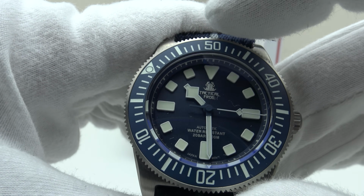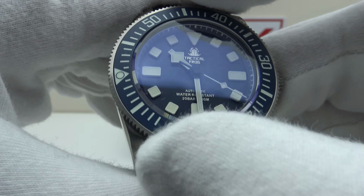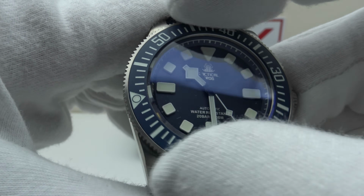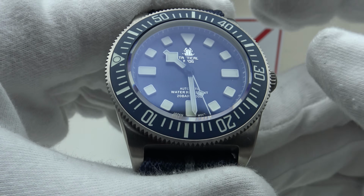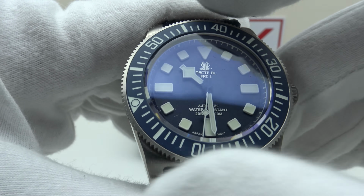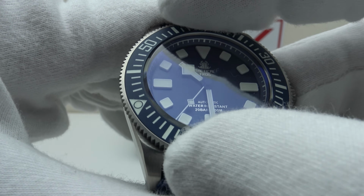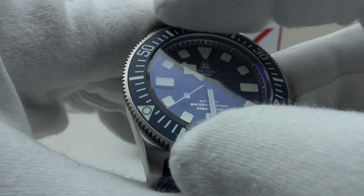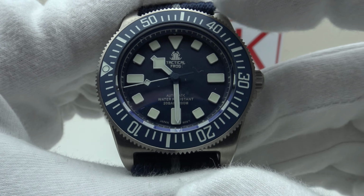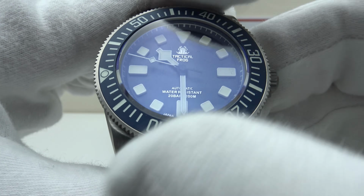The spring-loaded ball bearing underneath the bezel, which gives it its unidirectional action, doesn't feel as smooth as a bezel click spring. And I personally prefer the feeling of a ratcheting mechanism using a bezel click spring because it feels smoother. With a spring-loaded ball bearing, one can feel the ball bearing pressing against the grooves in the underside of the titanium, and the titanium feels like it has friction rather than being smooth as per 316L grade stainless steel. So it's not as pleasant to use as a 316L grade stainless steel bezel.